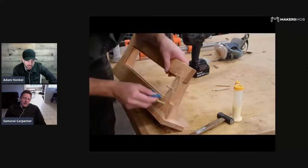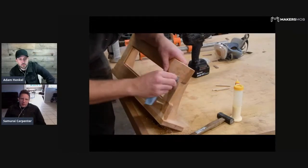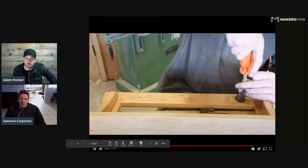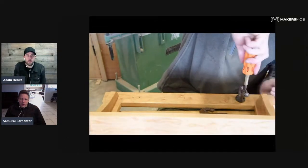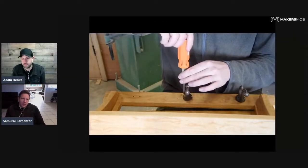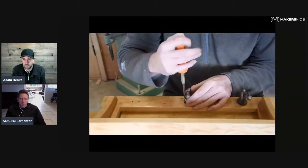Someone's asking how you attached that leather to your bar clamps. I tried contact cement, but I find that some of the patches were falling off. If I were you, I would use fast setting epoxy, those little syringes that you can buy for like $8 or $10. Just get some of that fast set epoxy, squeeze a bunch out on a board, mix it up, and dab it on there. I'm pretty sure the epoxy would hold better than the contact cement did.